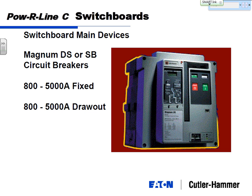If I'm standing here opening and closing the circuit breaker and any incident occurs, some blow up or a linkage busts, or maybe it's open now and I'm closing it for the first time and I forgot to take my screwdriver off the lugs in the back, if that failure occurs, you're in a safe zone versus a dangerous zone. That bleeds into the whole day Chad may spend on arc flash energy and the dangerous situations that occur with that. And I would always say, if you have an arc flash incident, it will cost you, what, like $5,000 for a piece of equipment, versus costing you an electrician's life.